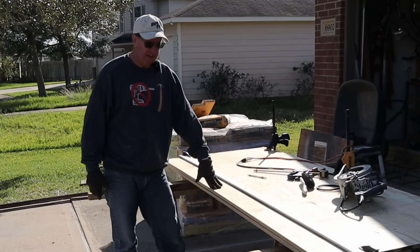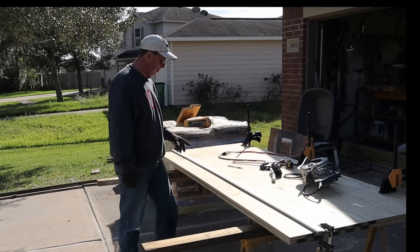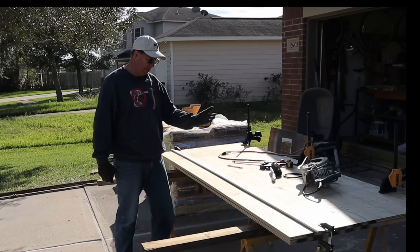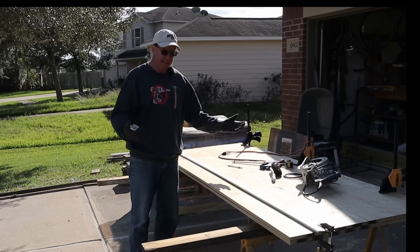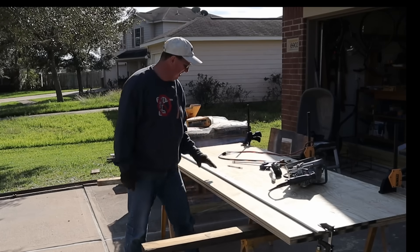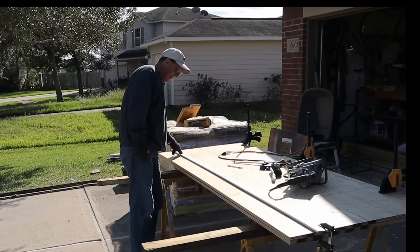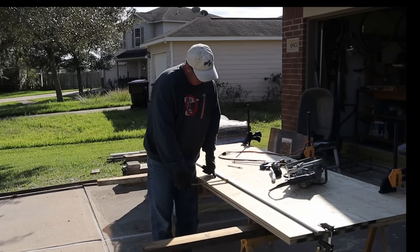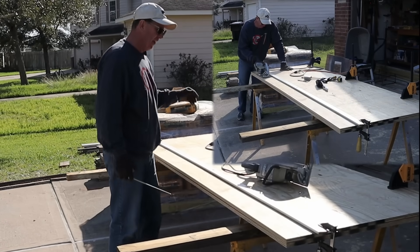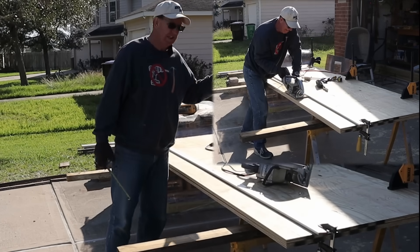For my forms, I'm using three-quarter inch plywood. I've got two sheets — four by eight — clamped together. The reason I'm using plywood is because I want my pour to be a full four inches thick, versus using a one-by-four at three and a half inches, then getting a one-by-six and cutting all that off with the waste. I don't have a track saw, but I've got a skill saw with a straight edge guide set so the blade cuts at four inches, and I'm cutting two pieces at a time so they're matched.